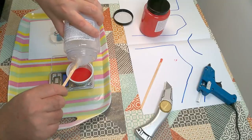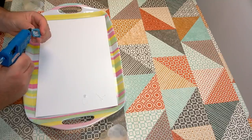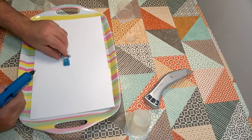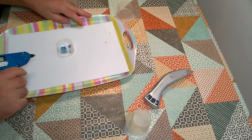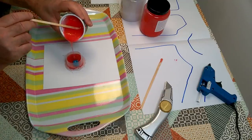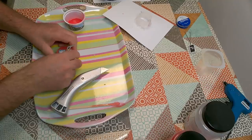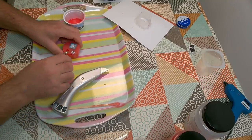So, the obvious thing to do here is try and make some of my own. I used a two-part silicone to make a mould based on the escape keycap. First, I stuck it down to a flat surface and also stuck down a few metal nuts — these will create registration bumps. I made a dam around the keycap with a cut-off piece of plastic yoghurt pot, then I mixed up my silicone and poured it in, trying not to introduce any bubbles. Once that had cured, I removed the silicone block from the casing, trimmed off a little bit of flash and removed the metal nuts. The second part of the mould will mate with these, and it will fit together neatly and hopefully consistently.